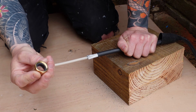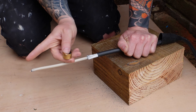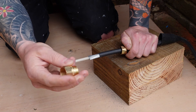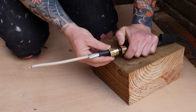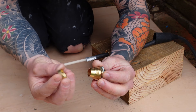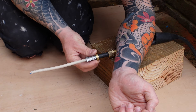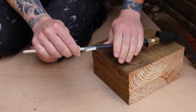The next piece to fit to the cable is the part with the rubber O-ring inside it. It needs to fit with the thread facing the end of the cable. Place that down and over the cable, followed by the middle nut with the thread facing inside, and then slide your wedding ring down the cable too. Before you do that, make sure you get the wedding ring the correct way around — it has a conical shape and needs to fit in the correct manner. Slide it down over the cable and leave these parts dangling down the bottom for now.